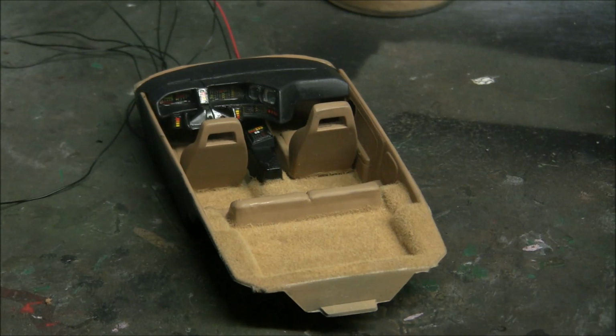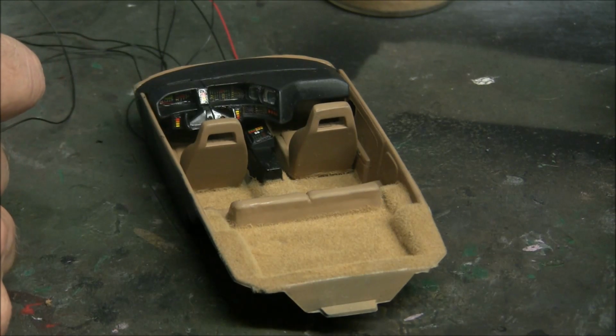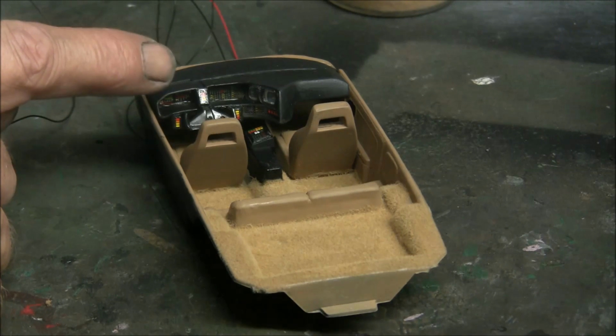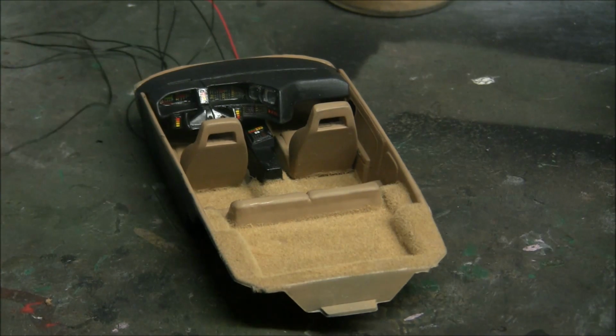And what we're going to do, I've got to turn my voltage way down here, guys. I don't have a resistor on that. What I've mounted inside there is a little 1.8 millimeter butterfly type LED. It's a really small LED, it's red, and I got it sitting in there. Then I took some clear sheet styrene and made a little lens for it on the front. I drilled a little hole through there, glued that over top of the hole, then I applied the decal on top of that.